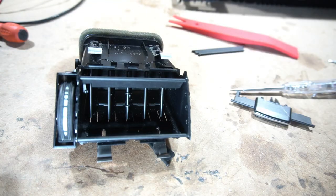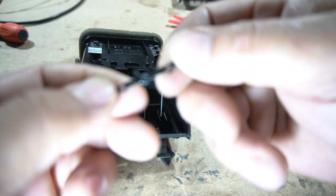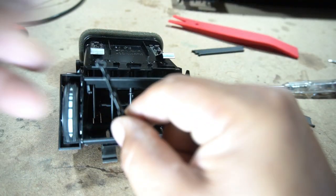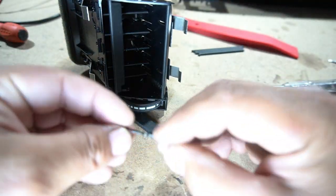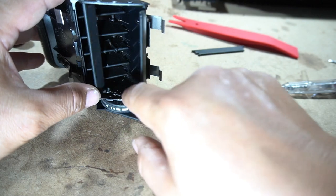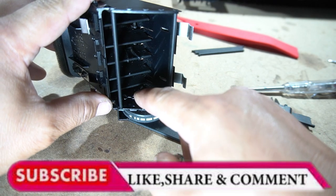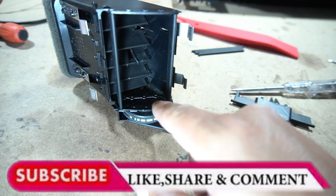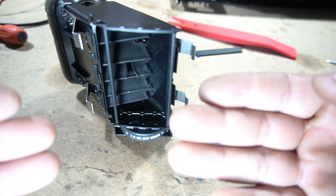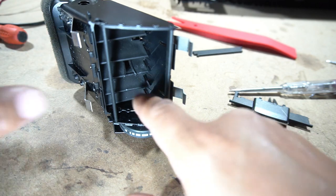From this point, put on the bracket. You want the point to face inside and towards the bottom rather than the top. Put it in like that — not like this, that's not how it goes in. Lean it over to the side, put one side in first and then the other. They will go in the bottom holes. Now what we need to do is pull it towards the front, because the slots on the bottom and the top are bigger — it needs to allow the louvers to flap all the way up and all the way down, and that allows it to move in and out as well.